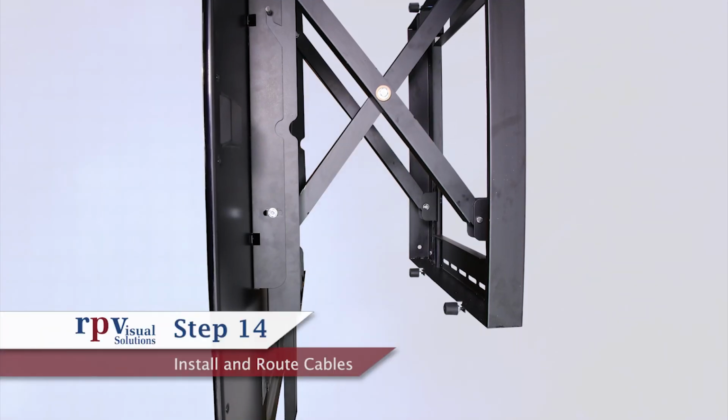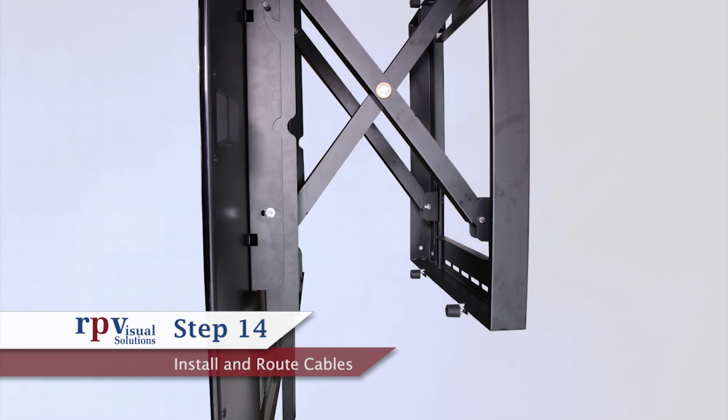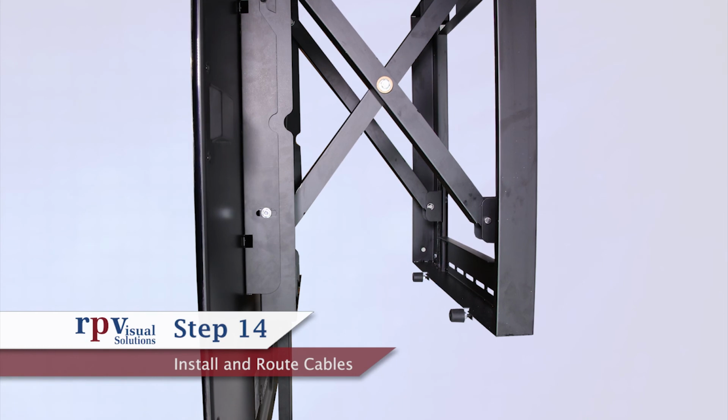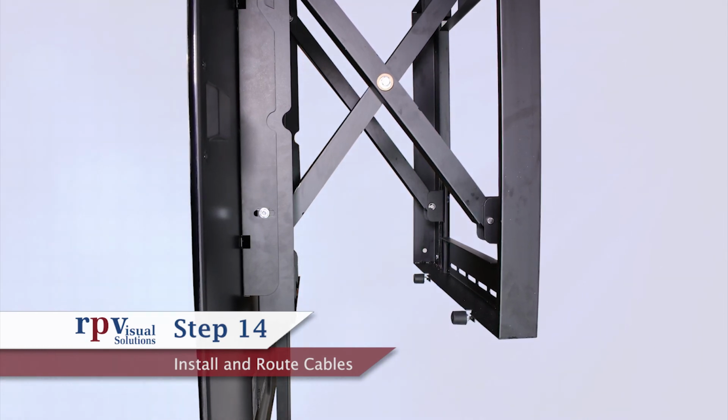Step 14. Install and route cables. Finally, install and route display cables with the X-Arm fully extended in the service position. This will ensure there is sufficient length on the cables to fully extend the mount.